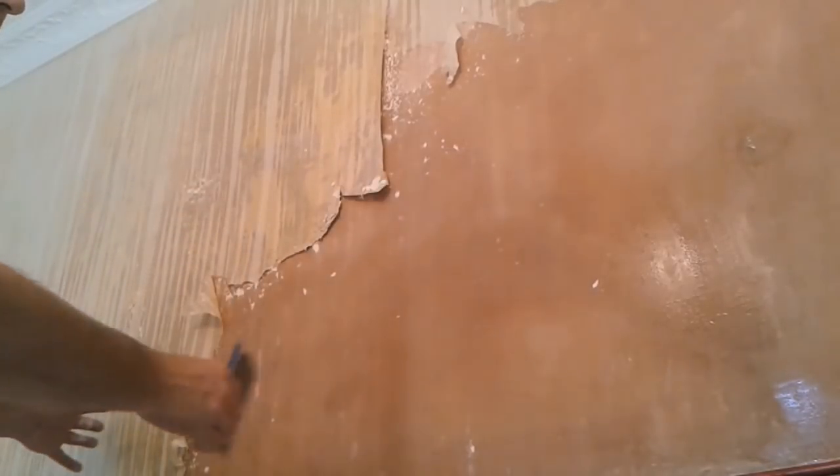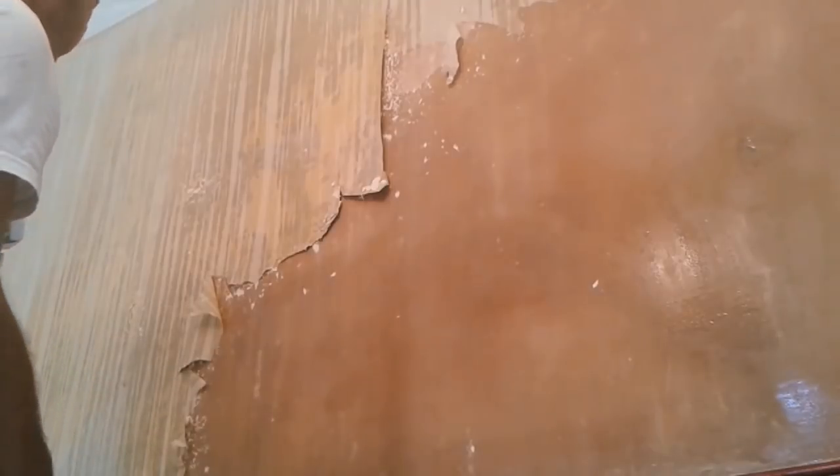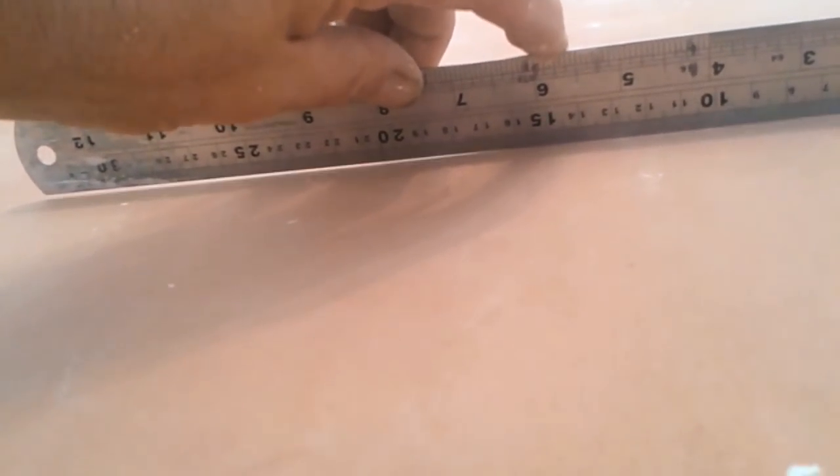When I clean off the whole wall I'll change my water and go back over it just to remove anything I've left on. So paper and all the paint off this wall — all the paint apart from anywhere where there's any slight deviations in the plaster, like a bit of a hole there. The paint will sit in any of these areas with dings. Here, literally straight up — there's a joint in the board. If I just get my straight edge on it you can see how much that joint is out.